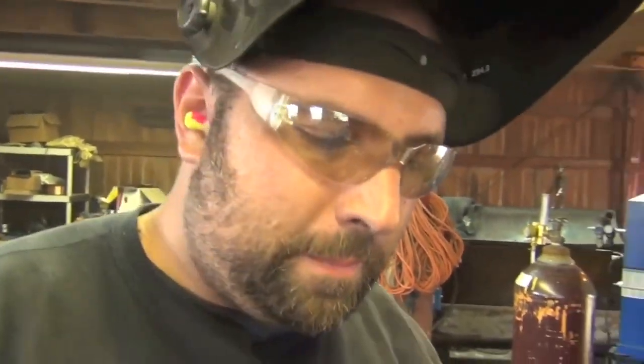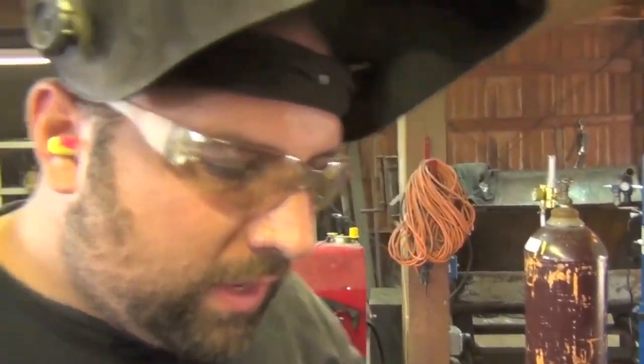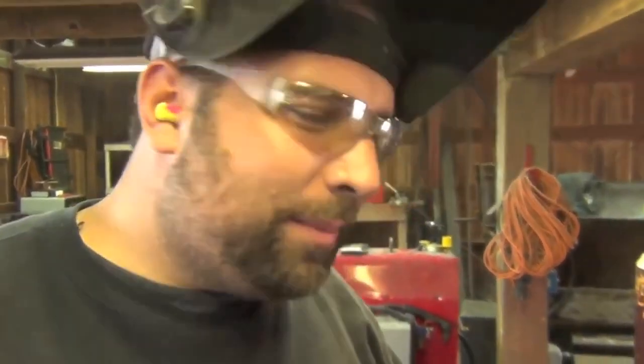Excellent. That sounded kind of sputtery a few times. Do you think that's just because we're running 240 amps? Yeah, it's a constant voltage power source. It's not exactly the most ideal scenario to run these electrodes. And maybe I'm a little bit rusty. Normally I gouge off an engine drive and I have other power available.